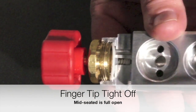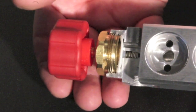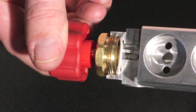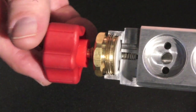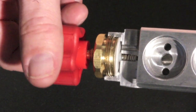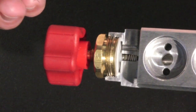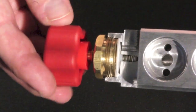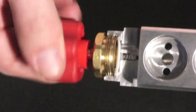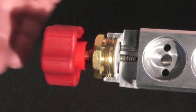The seal is right here — it's a very nice, tight seal. The advantage is it's fingertip tight and completely sealed off, and then only about one turn and it's fully open. You never want to take a diaphragm all the way back and back seat it, because you'll jam the handle and it really won't open any further than one full turn. So it's one full turn to close, one full turn to open, and the diaphragm is fully open with full flow through the porting.